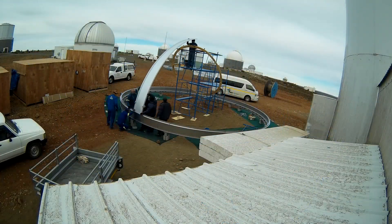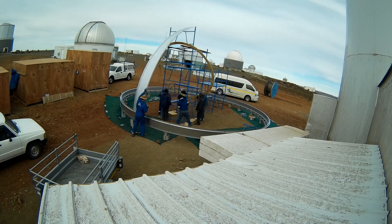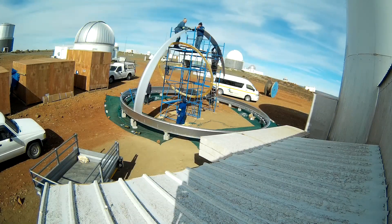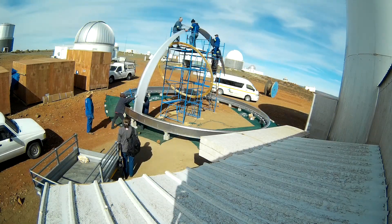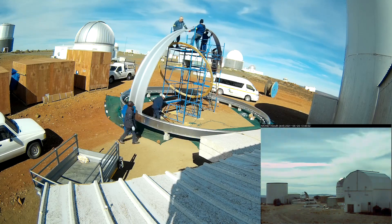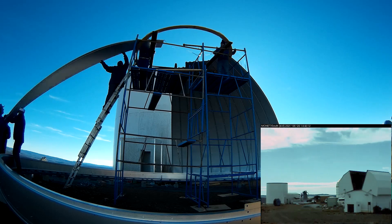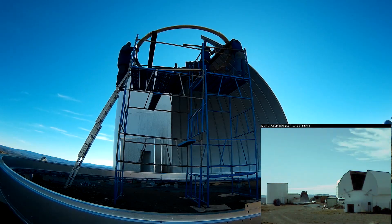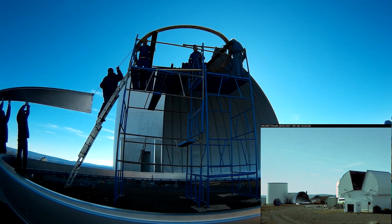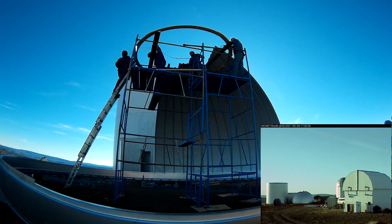One starts at back center, working your way around. The scaffolding was tweaked as it became clear how wide and how high the apex of the dome was going to be. As more panels were mounted, we slowly got the hang of this and soon became a well-oiled machine. A great improvisation was to use a rope to help handle every plate — first up to the top, then across the top, and finally to help pull it down the other side. The rope even helped guiding it to stay engaged while sliding it in.